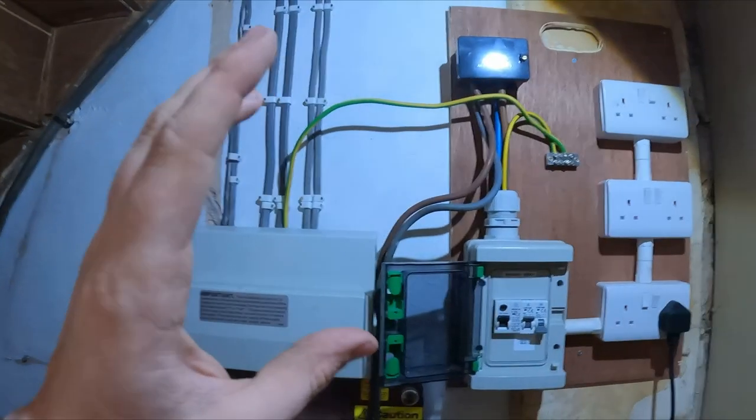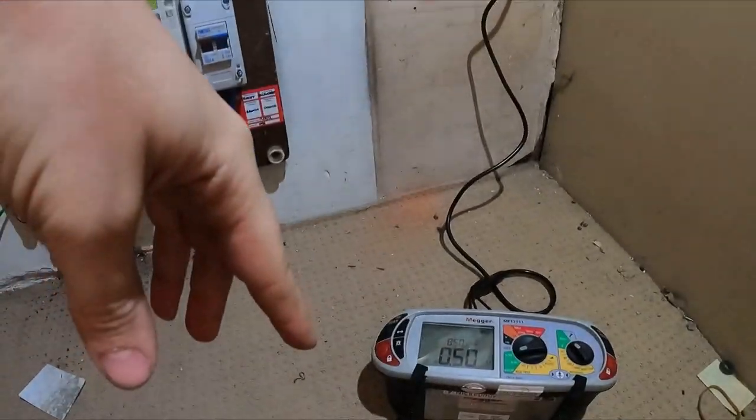If we've got a good connection I can't really see an issue with leaving it, rather than getting them out again when they've clearly been out at least twice recently. If you ever make a temp board and set it up, please make sure you stick a tester across it to confirm you've got an earth before plugging anything in. Most tools are Class 2 anyway, but better safe than sorry, especially if other people are using it when you're not there. I'm going to go do a video in this house as we start the rewire next week — how we quote, things to look out for, and all that. If you enjoyed the video, drop a like, subscribe, and I'll see you on the next one.